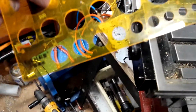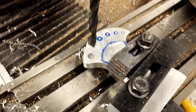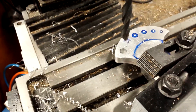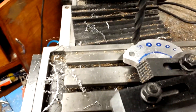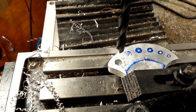There's the plastic stencil I used to mark out the holes — much easier than compasses of that size. For the bigger holes I'm winding them out in increments rather than trying to drill them all to size the first time. I had a drill in there that was about 6 or 7 or 8mm; this one is 10mm, then I'll go up to 12 after this. I won't film all of this as it's just repetitive, but each hole will be found with the wiggler, centre-drilled, and then drilled to size.